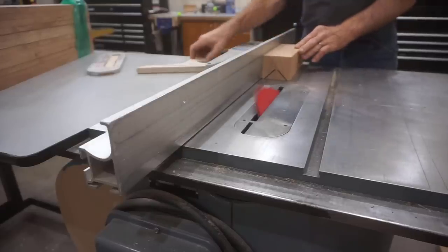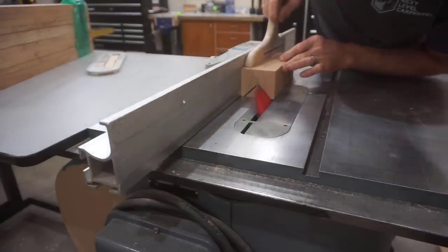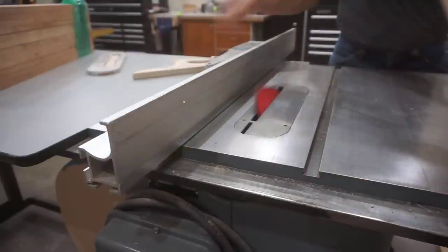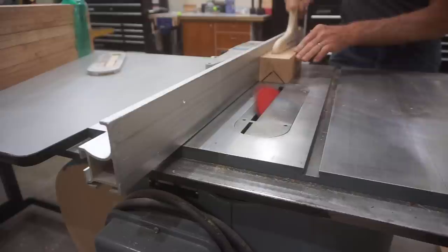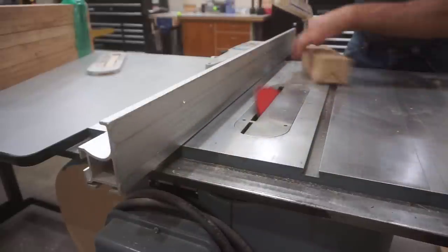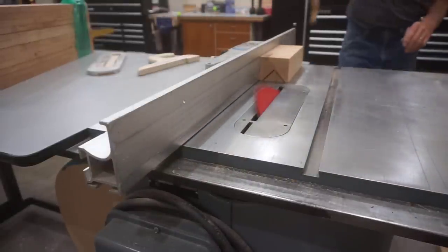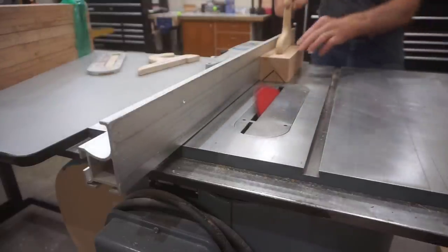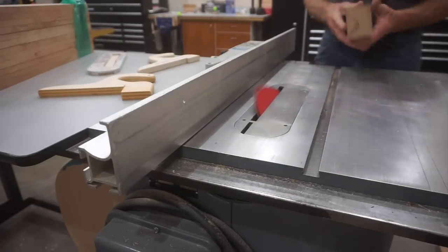Since I chose golf balls to use for hanging these ducts, I need to safely and accurately drill holes through the center of one golf ball for each hanger. To get that done, I use what I call a double V block fixture. To make it, I first ripped a 45 degree groove in the face of a chunk of scrap wood about 10 inches long, making this V cut in a couple of passes to sneak up on the final depth.